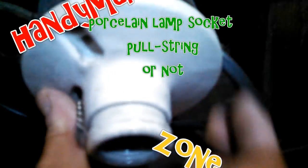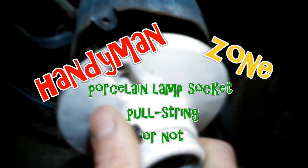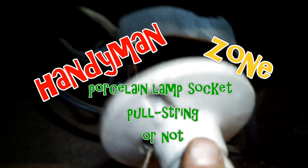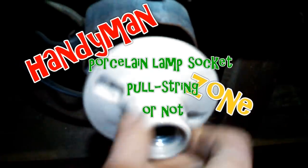There's a screw here and a screw here, and you'll take those out. Some of them will have enough slack, but with the older ones, you unscrew this porcelain, and then you would be able to get to the screws. You've got a white wire and a black wire. Let me see if I can get you a better shot of that.